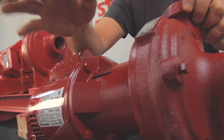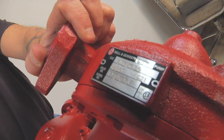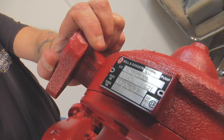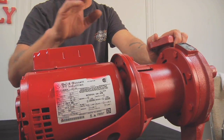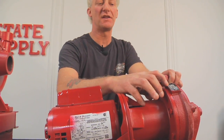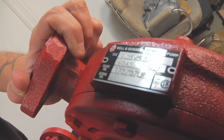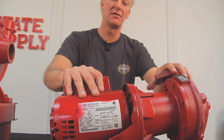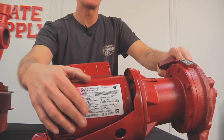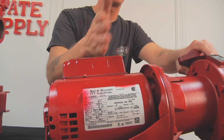On these Series 60s, all of them come with a steel identification tag that's riveted to the volute body. This is a stock pump — if you notice the bottom part number here, it's six digits. All of the Series 60s, whether they're maintenance-free or oilable, start with a 172 number. If you can find that 172 number anywhere, that's going to be the complete product number for this whole pump. If the tag is missing, go by the casting number on the volute and the horsepower rating — single phase, three phase, half horse, three-quarter horse. It helps us identify all the individual parts on this pump.